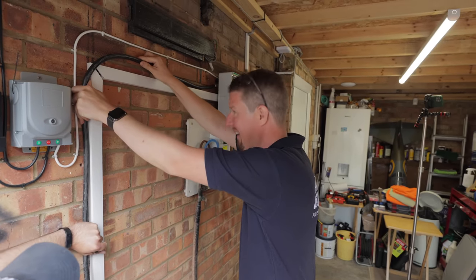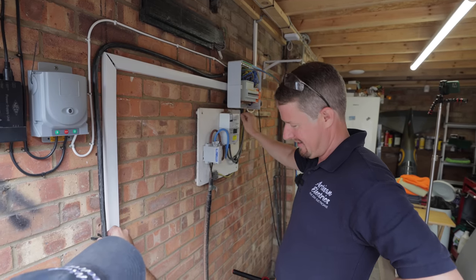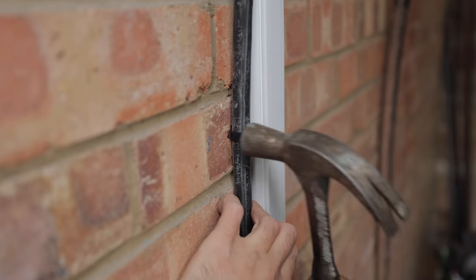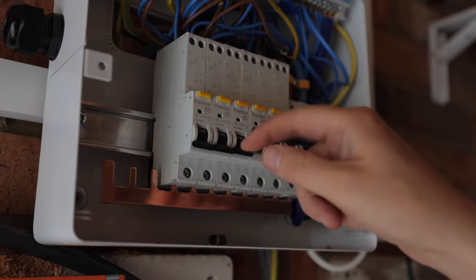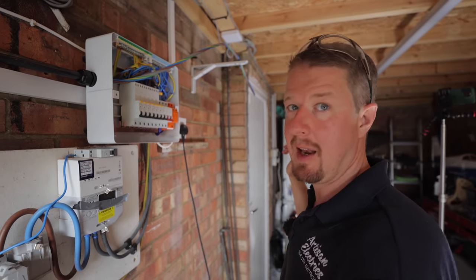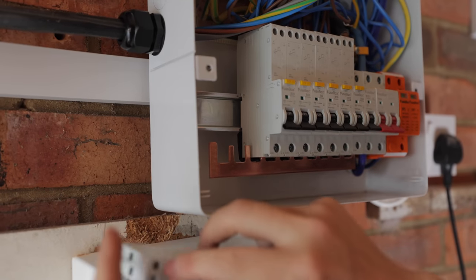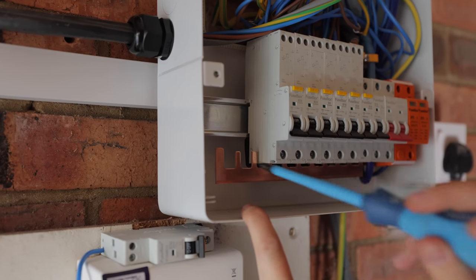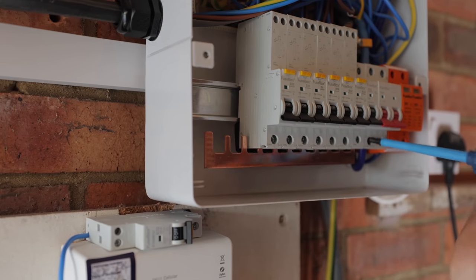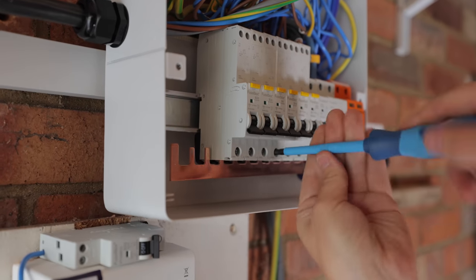No way. How is that possible? I measured it off way too long. We've got permission to turn the power off now. The cable's here at the board, all clipped both ends — I think it's connected at the other end. Just going to connect it into the RCBO at this end and we're doing good for time. John very cleverly pointed out that they've actually connected the bus bar the wrong way around — this bit here should go out of the main switch. They've just put the thin end out of the main switch, so we've isolated the power — it's safe for me to fix this.